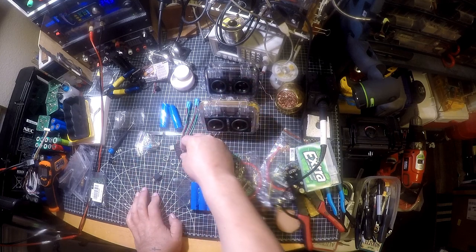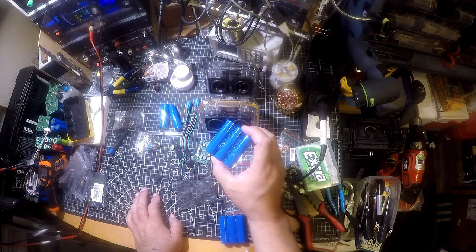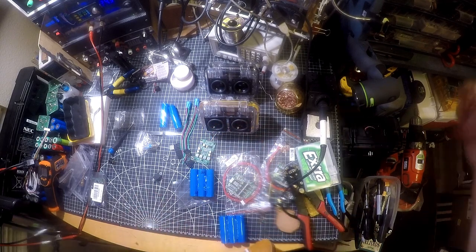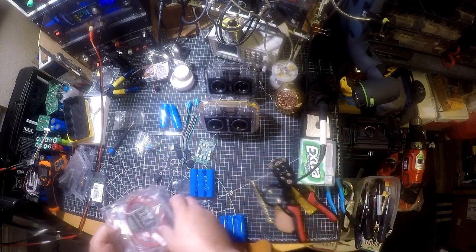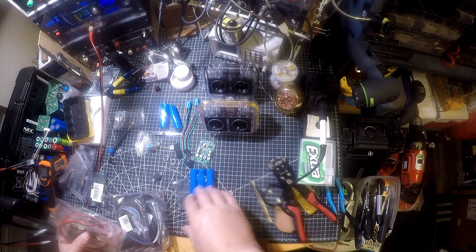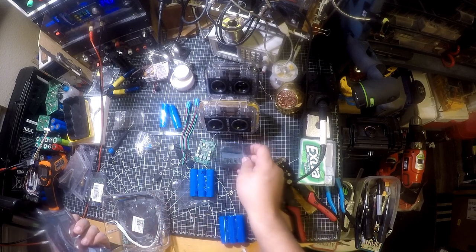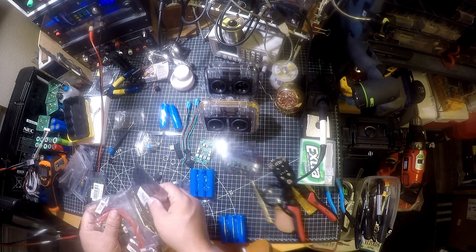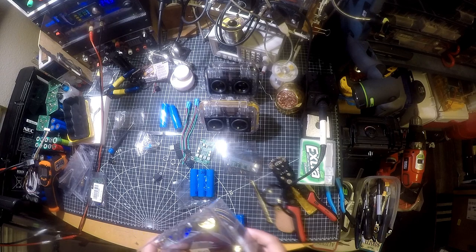The DC jack to charge the amp, and the battery. I'm probably gonna have to use one of my older 3S BMSs, because a regular size BMS won't fit. I won't have enough room. But I have these little bitty things right here. They don't balance, but they protect. And I've seen lots of people use those before too, so.